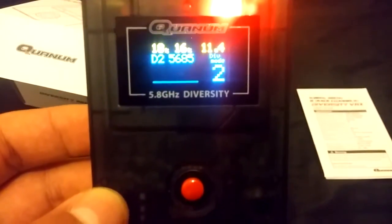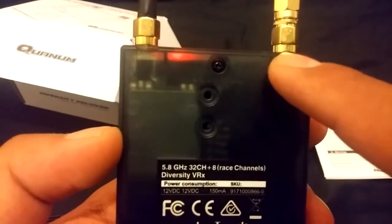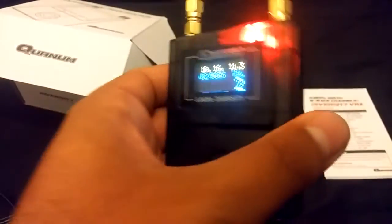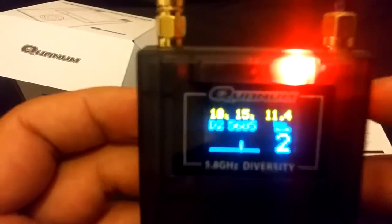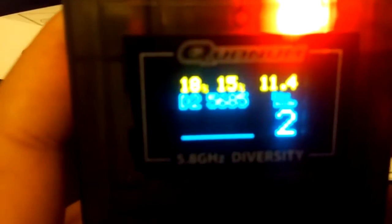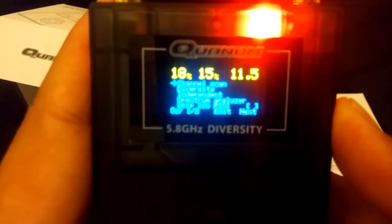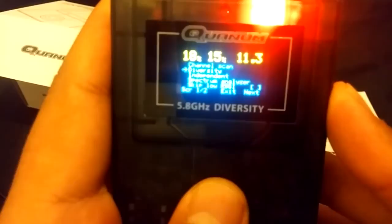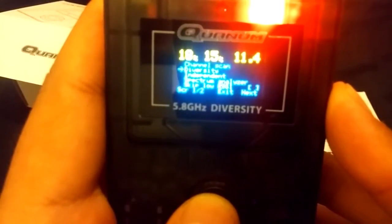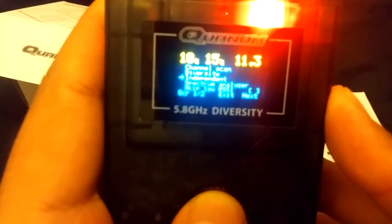DIV mode, or diversity mode 2, means the second receiver is on at the moment. Remember, it has two receivers. Right on the back of the unit you will see antenna 1 and antenna 2 written on it, so you can determine from there what kind of receiver you're using. Now, if we focus on this thing — there's a red button down here that is a clicker and a cursor at the same time. Going into the menu: Channel Scan — this is where you scan your channel to find your video. Then Diversity — that's the diversity mode or diversity RSSI. You obviously want to keep it in diversity mode because that's when it decides on its own which receiver to use.